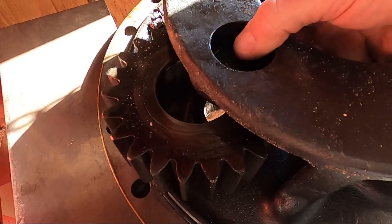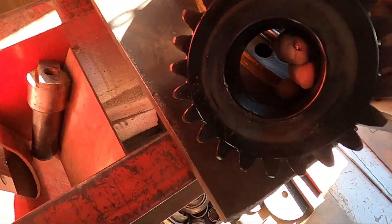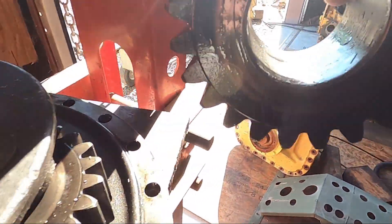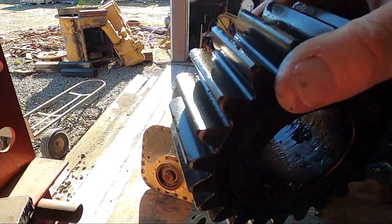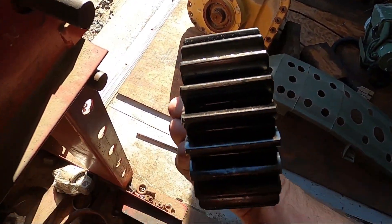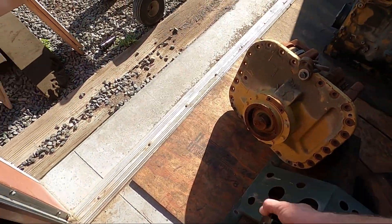I have to get that pin out and slide the gear out. It's amazing - the bore is barely messed up. These gears are so hard that you would think the bore would be totally destroyed. If the operator had caught it early, the gear would have just chipped up and you probably could have reused these gears. But here's $400 in the trash right there.